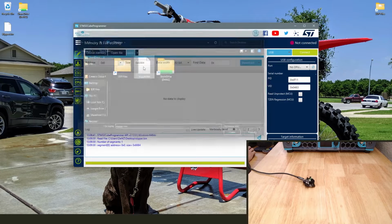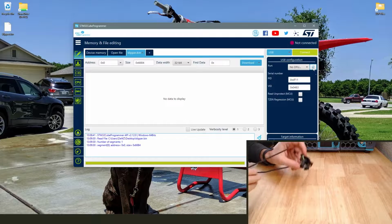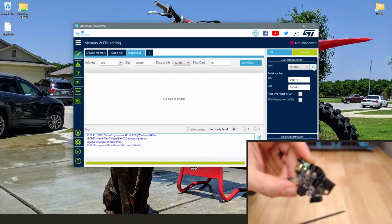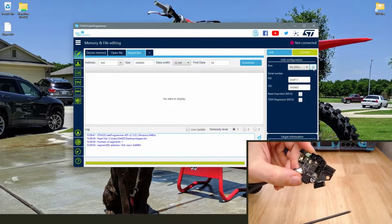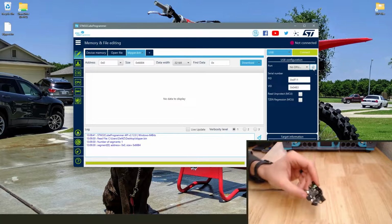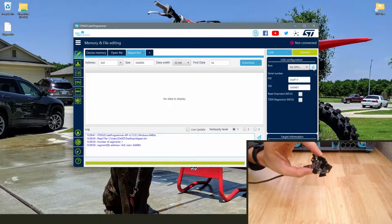Alright, so we're going to go ahead, open up our firmware file that we transferred over from WinSCP. Now you can see that there's no units in DFU mode, so we're going to go ahead and put our board into a flashable state. There's the 2 buttons, one's on the bottom since the board's upside down, but it's by the main connector. You're going to press and hold that one, and while you're holding it, you're going to press and release the button right next to the LED. So press and hold that one, press and release that one, and then release the first one again.